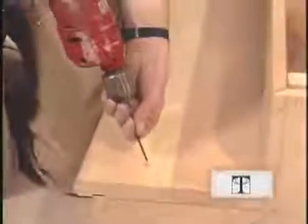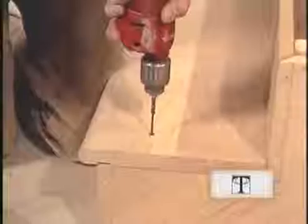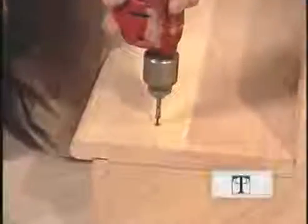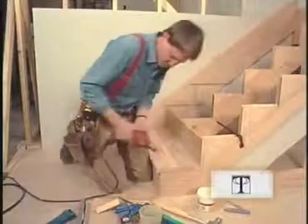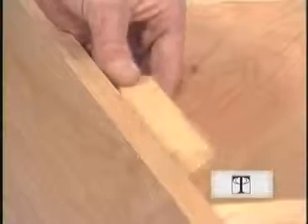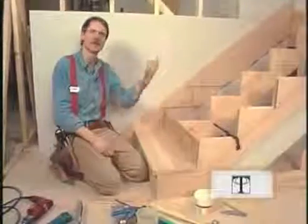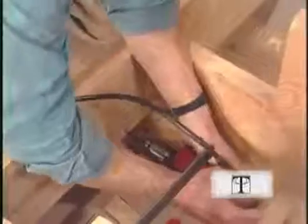The next thing to do is to fasten down the tread. Now this can be done with large finish nails, but I like to use screws. Later I'll plug them and they won't show. I'm going to put these glue blocks in place underneath. They'll meet the riser and the tread. You can't follow me under there, but I'll show you when we get a little higher. And the final step is to run some screws through the back of the riser into the tread.